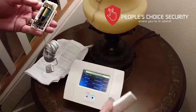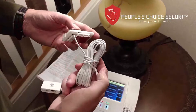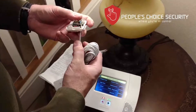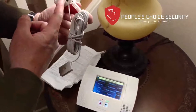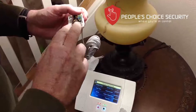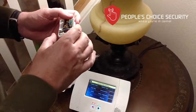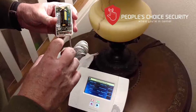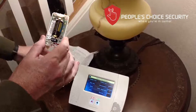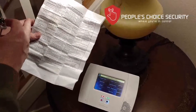What we're going to do is remove the lid and install the battery. In this case we're going to use the flood sensor that came with it. I've installed it through the back hole here and into the screw-down terminals — they're not polarity sensitive, so it doesn't matter which wire goes to which. You'll also notice there's a resistor and a dip switch. It's important to look at page three of the instruction manual to see how to set it up.